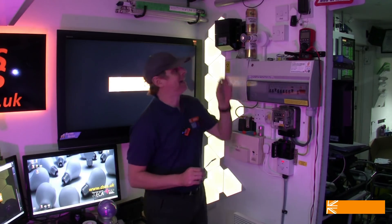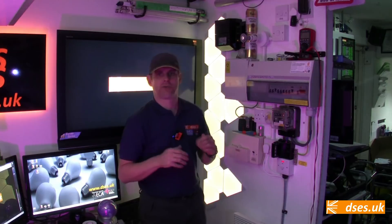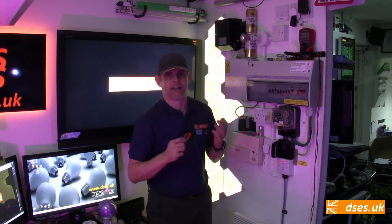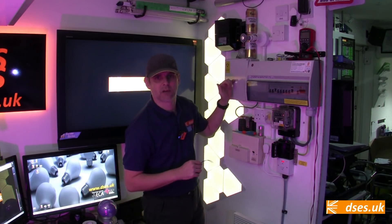To very quickly recap: my LED lamp here is all aglow and it's supposed to be off, simply because the voltage on a neighbouring energised circuit serving just this socket outlet has created an electric field, which is allowing a small current to pass. This is down to the way the wiring of the two circuits has been run inside this fat plastic box.